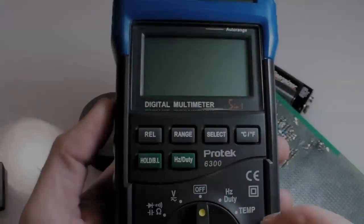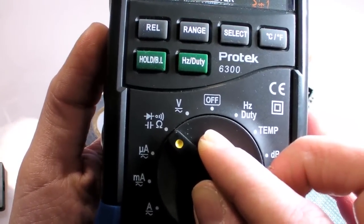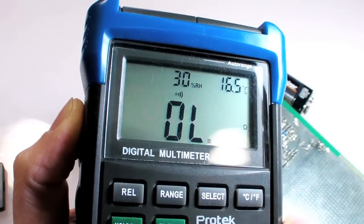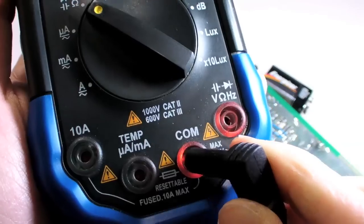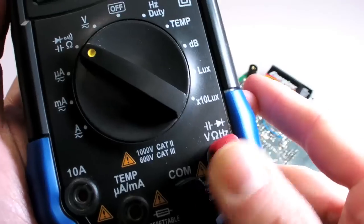The simplest and probably most useful thing to test with a multimeter is continuity — whether or not two points are electrically connected to one another. Continuity testing is super helpful for troubleshooting, soldering work, circuit board traces, or even if an old cable needs to be repaired. First, switch the control dial to the continuity setting, usually marked with a diode or audio symbol. Most meters can produce an audible beep to indicate continuity, which is handy when you need to keep your eyes on your work.